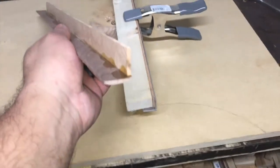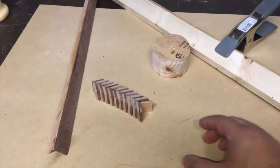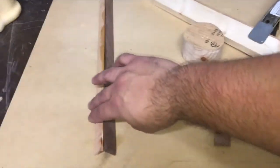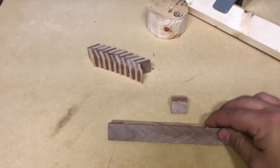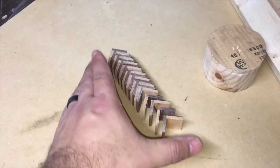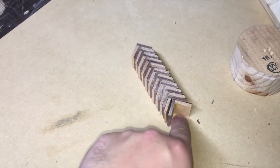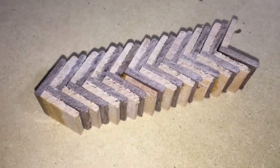What that's going to help you do is give you a perfect 90 degrees that you're going to take off that arrangement. Once you have that taken care of, you're going to use either a miter box or a band saw to cut little slices like this. Put your board like this — however is safer for you — and cut a little slice, going all the way down. Once you do that, you just flip them, alternate the colors, glue them together, and the 90 degrees are perfect so you don't have to struggle with the glue-up.